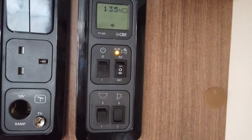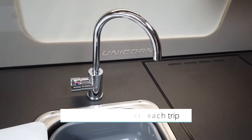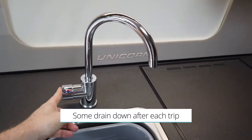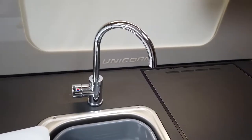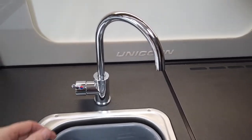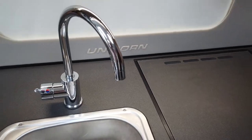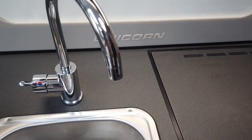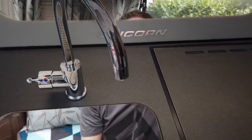So you turn the tap on, this will light for a little while and then go off again. Now, what I forgot to mention is that in winter if you drain down your water, you need to go around and make sure all the taps are closed. Last time we were out I'd made the mistake of closing all the taps but left the shower tap open, so when I connected the water and turned on the pump, water was spraying out the shower head — a bit of a schoolboy error. Remember to close all the taps when you come back into the caravan. Also be careful when running the tap for the first time after draining — there'll be air in the system so it will splatter and you might get soaked.